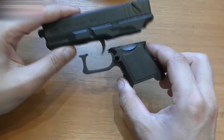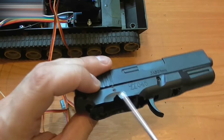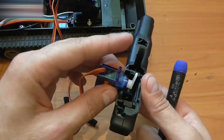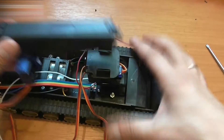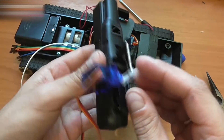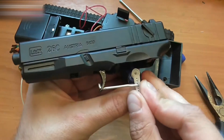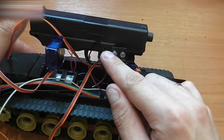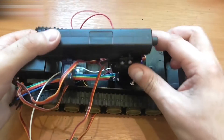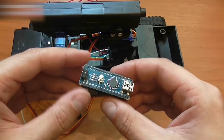This is what I have done. I've made a small hole in the top part of the servo actuator and another one the same size and diameter on the gun. I've screwed in a screw a little bit and now I'll connect them like this. Now, I will attach the gun to the top part of the rotation system. Using a two-millimeter drill bit, I drilled into the trigger and the cap of the servo actuator, then placed a wire there. In the top part of the mechanism, I've made two holes that go through the barrel as well. This way, I've secured it.